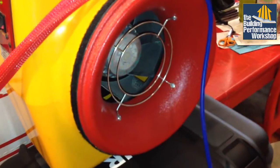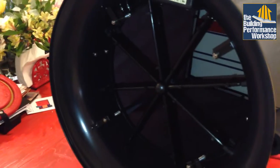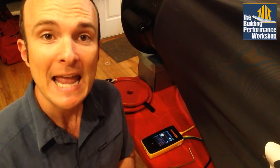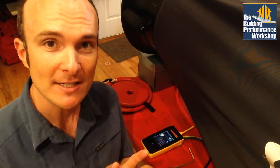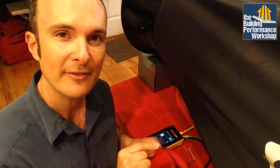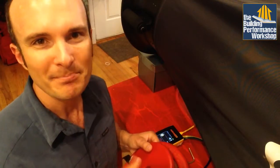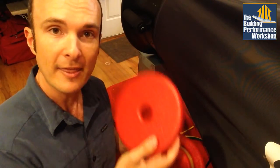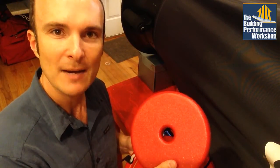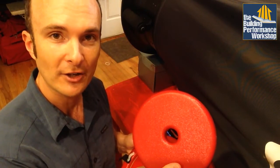What's special about the duct testing fan is that it is built to send very specific amounts of air into a system through a motorized fan and to measure that very precisely. You need to know which ring you're using. I'm measuring residential flows between about 50 CFM and 300 CFM, maybe 350 at the high end. This very small ring moves between about 10 and 50 CFM, so I'm going to use it on the very low end.